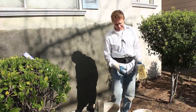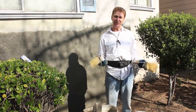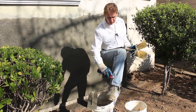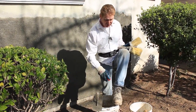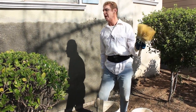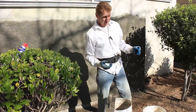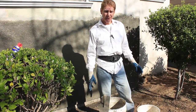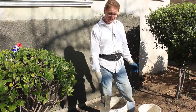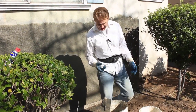Just got back from the material yard. I had to get a new dash brush when I got sand, because my other one took a crap on me — that's what cement does to you. That's why every once in a while I'll spray my shoes. For you young bucks that just joined the union — spray your shoes a little bit so this doesn't happen. The lye eats them up. And you tough guys that don't wear gloves — just a couple weeks ago I said to a guy, 'Where are your gloves?' He said he didn't need any. I said, 'I must be a smart one, because I'm smart enough to know this stuff has lye in it.' It's carcinogenic — goes in your bloodstream, beats your liver up. So wear gloves.